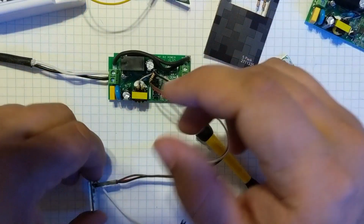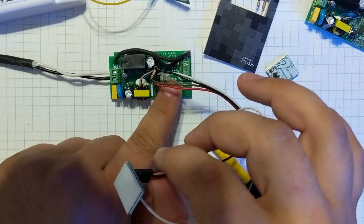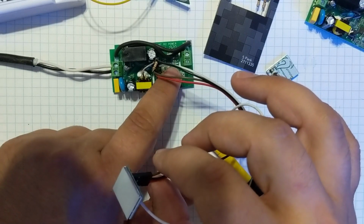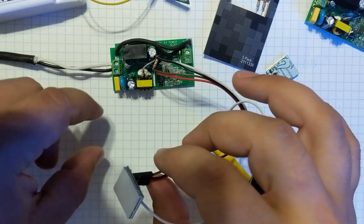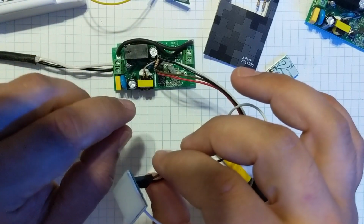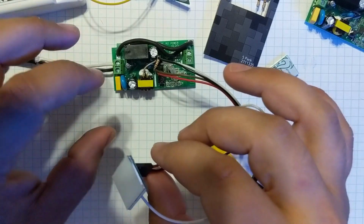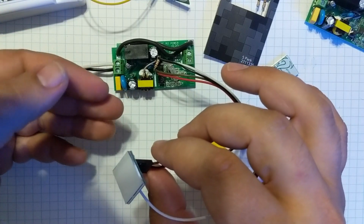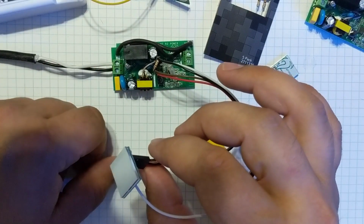One other really cool thing in the programming is the onboard LED no longer works. Well, it does, but it's turned off via program. When you used to start up the Sonoff, this would flash, which was basically a status light, as well as showing the power to the relay. It showed you both statuses. When it powers up, it used to blink, and what that means is it's connecting to Wi-Fi. Once it's connected it went solid, and then it turned into the LED for whenever it was on or off when you're touching it or turning the relay on and off.